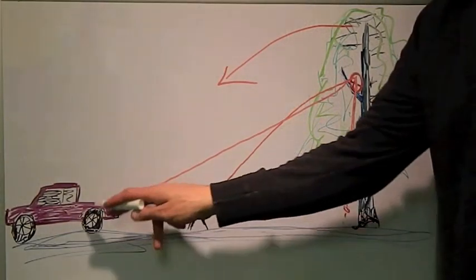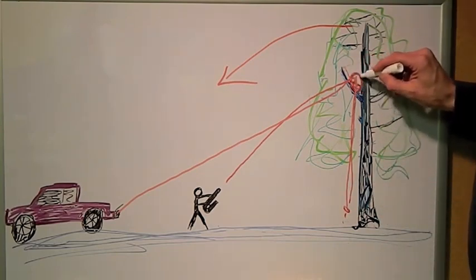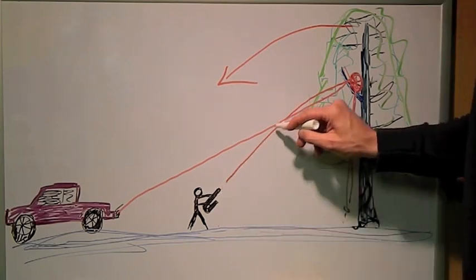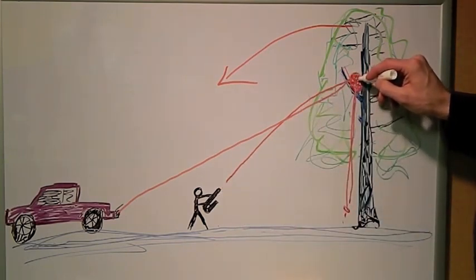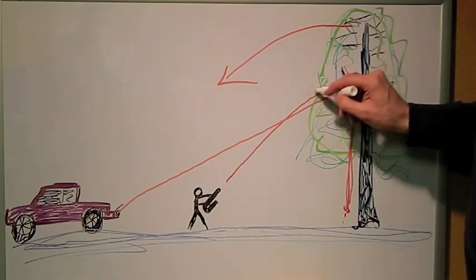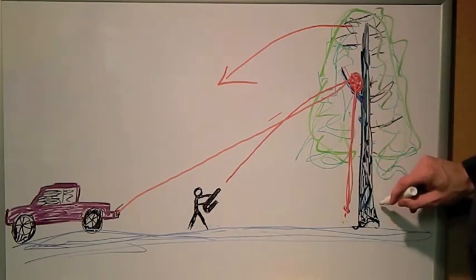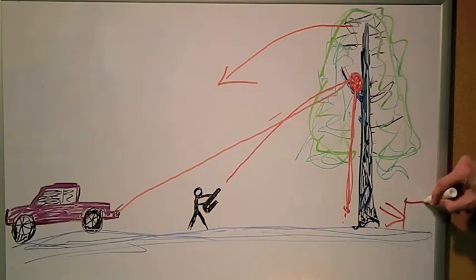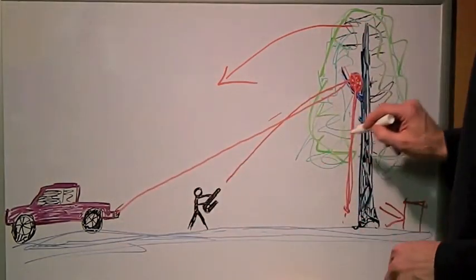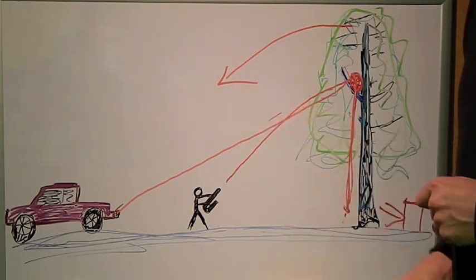Check this out — here's the scene. Here's my truck, there's me with the air cannon, and here's the big tree. It has a big limb up high and right up here is a clear area — that's the target I want to hit with the weighted bag. I take my air cannon, shoot the line with the weighted bag on the end through that area, it goes over the branch and comes down. I can tie a big rope to the end of that line and pull it back through, hook it onto the hitch of my truck. That way as I'm cutting the tree, it wants to lean back toward a lean-to shed I don't want it to hit. So I'll cut the tree and have somebody pulling the truck forward on my signal to safely drop it the way we want.